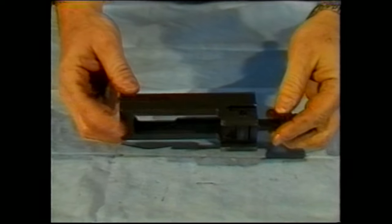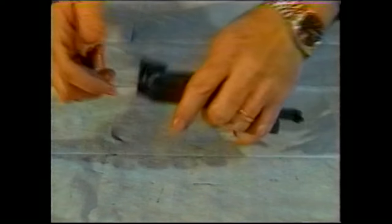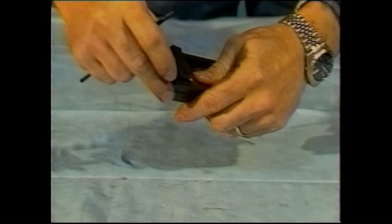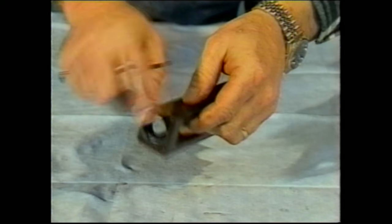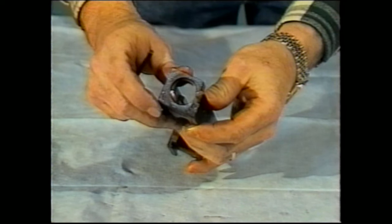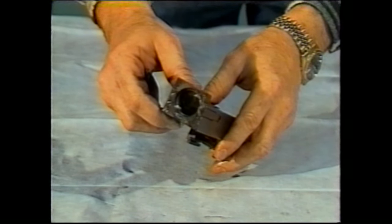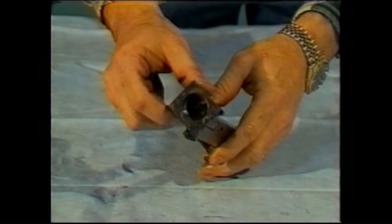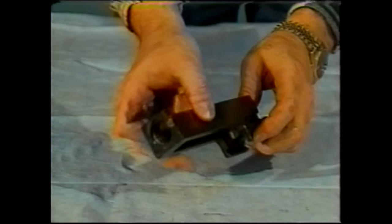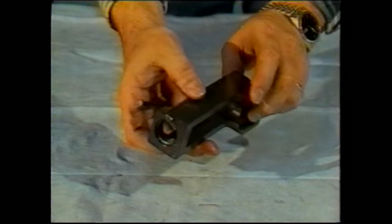There are only two parts to a barrel extension that can be removed. Those are the small tension spring on the front. The tension spring engages in notches in the barrel end. These serve to cause the head space of the barrel to be retained during firing so that the barrel doesn't rotate during firing. Any barrel rotation during firing will cause the head space to change during firing.